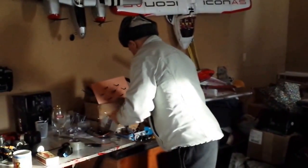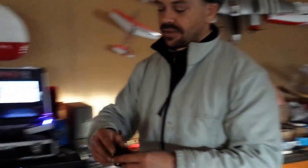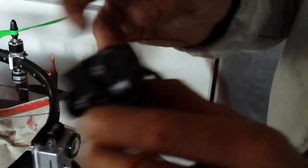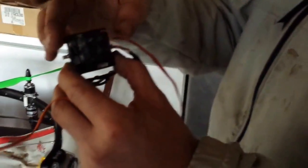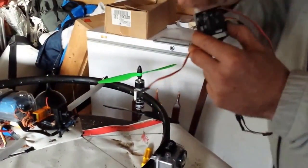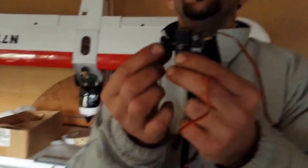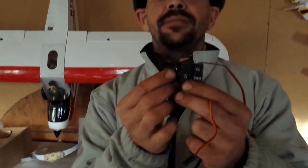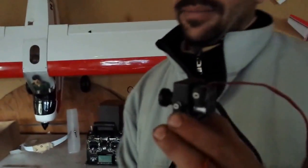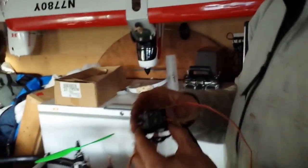This is a camera that's been fitted with an actuator or a servo. You're going to get really used to these because they're like the power arms. The little actuator and the arm connect to the unit here, so as it moves, it just goes. What controls that motion is either you, by intention, in camera mode, or the APM 2.5, which actuates this and puts you on auto level. So you tell the APM where level is, and as the craft moves, it will consistently find level. It's not going to pan. Now, you could put pan on it, but as we've talked about, it's too goofy. The yaw takes care of it.